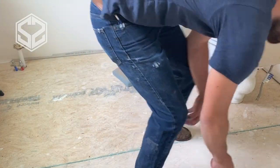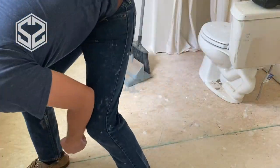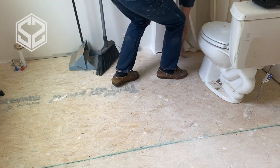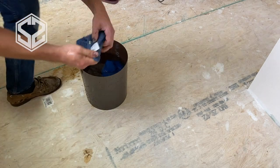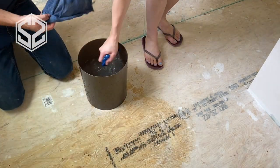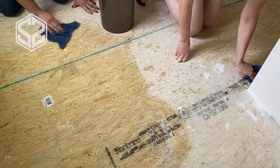Then I need to take a spackle trowel. I'm going to scrape off any spackle that has been left over from the previous job and scrape that off, level with the floor. Now I'm going to try to get it as smooth as I possibly can. I know this flooring has a foam base on it, so it's pretty forgiving if there's a small lump. It will go right over top without showing, but I want to make sure it's perfectly level before I start. Now we've already swept the floor, scraped all the spackle off, and any clumps that were on the floor have now been cleaned up. I'm just going to be extra safe and just wipe down the floor with a wet rag. This will absorb any dust that's on there, and I can make sure that all the spackle's cleaned off of the wood before I start laying the flooring down.